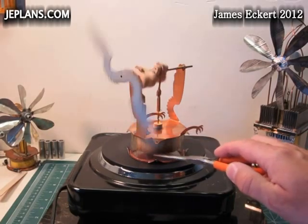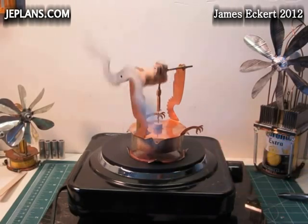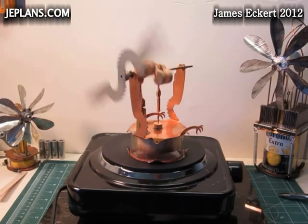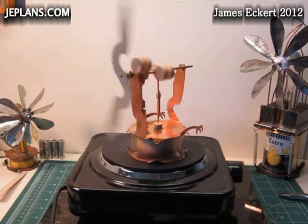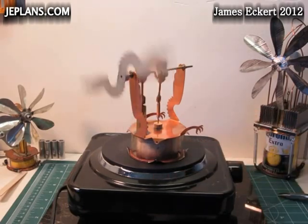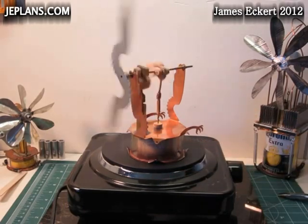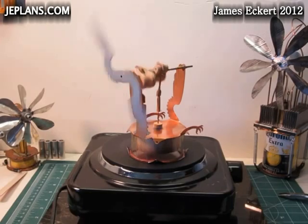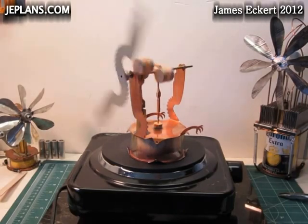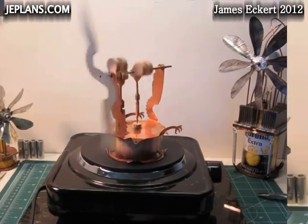Notice there are no longer springs holding the top to the bottom. That's because the bottom seal proved too tight to remove. Removing the springs also reduces heat transfer, which is actually beneficial in that sense, although I did want to replace the displacer with one I didn't burn quite so much.